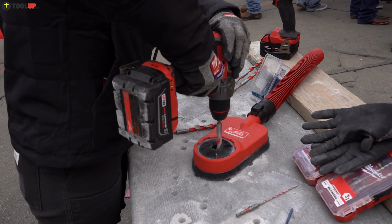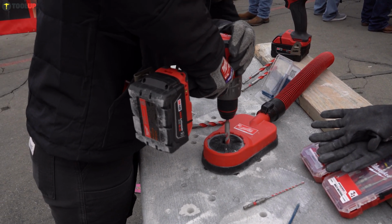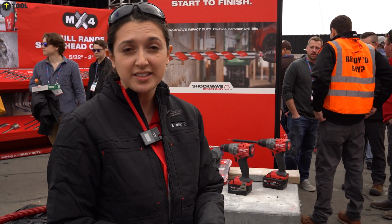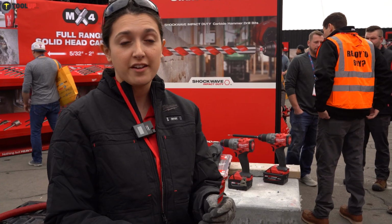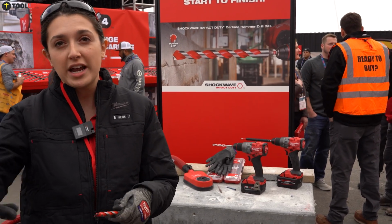Ultimately, as you're drilling into the material, you're going to get more contact with that material, digging that out of the hole faster. You're going to get up to 4x faster drilling speeds, and because there's less wear on each surface, you're going to get up to 9x longer life. This is available on diameters 3/8 and up across our range of different lengths.